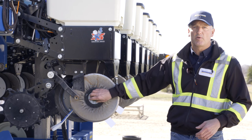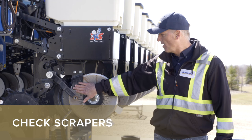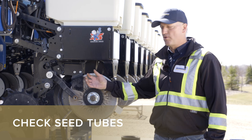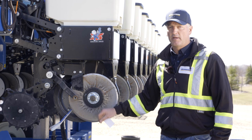Another reason for taking parts off the disc is to check your scrapers — make sure they aren't worn or bent. You can go one step further and actually take a disc off, because between your discs is your seed tube. Check the seed tube to make sure it's not cracked, that there's no dirt stuck in it, or that birds haven't built a nest in there. That affects how your seed drops, which affects your seed placement — the main feature you're after.